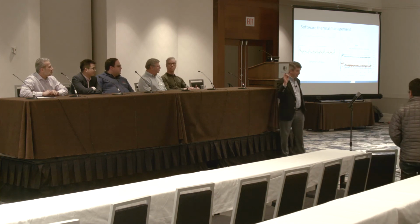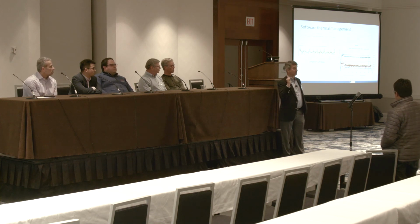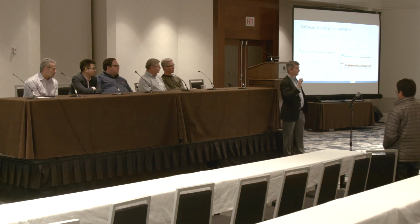Well, please, we're listening. Well, I can't really talk about it. There have been, please come up to the microphone. As we all know, there are a few manufacturers who are now producing ultra-thin vapor chambers: Novark, who's here at the conference. We've also worked with people like AVC, and there are a few others who are mass production capable. And these vapor chambers work. At 0.4, I haven't seen very high power capabilities. At 0.55, these things are very impressive. If you need to spread heat and can spend a few dollars, don't hold back, you should investigate.